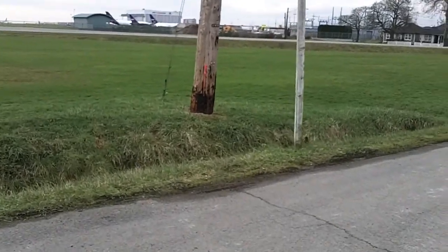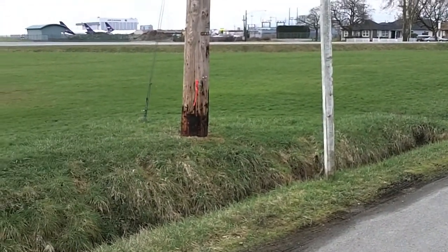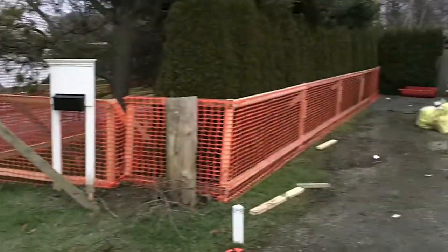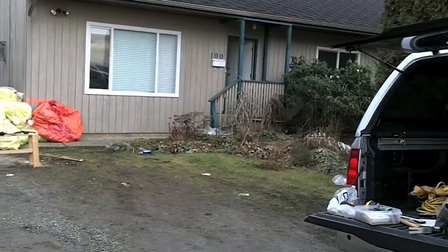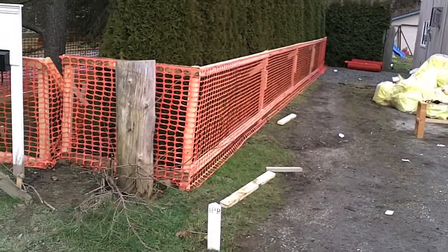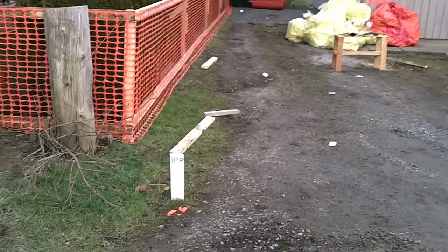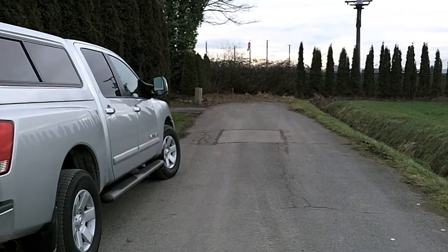First thing I'm going to show you is our elevations. We've had our elevations shot onto some objects that are close and transferred those over onto the house — there are elevations for both sides. You can also see our property pins are in. We have to figure out where the corners of our lots are, and here there are two lots. There's one corner here and the far corner is on the very far side — you can just see a little bit of orange down there.